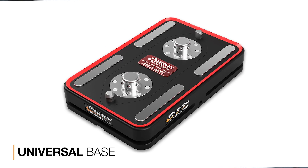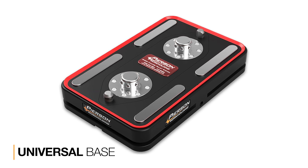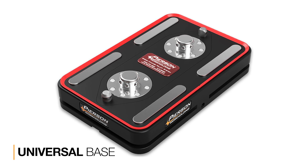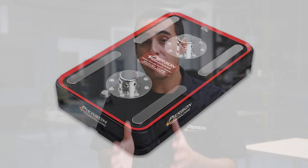The Pro Pallet system base is even more robust. It has a cast iron core in which the locking components and the two pins — round and diamond pins — are all held. It's still very robust, but that aluminum carrier is just a way for it to carry the cast iron components that are very thermally stable.